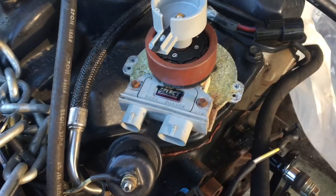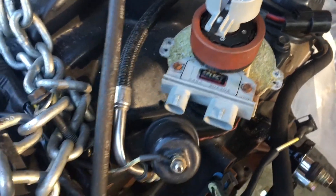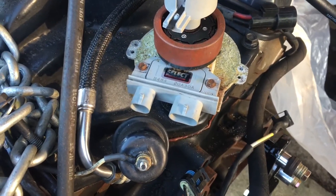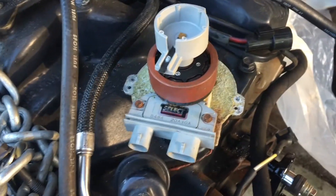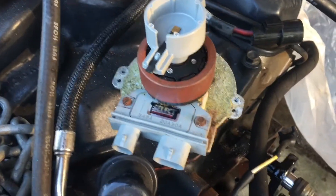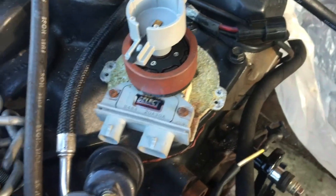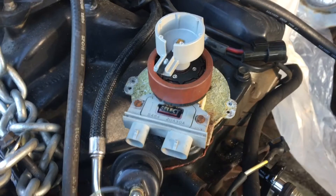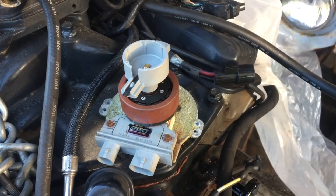So that's how the timing works. Marine systems are basically similar to cars, and they have built-in timing curves — that's what your marine engines are running off of. It's really not that complicated: you just take your timing tool, hook it up to your distributor, crank it up, and once you connect 12 volts to your bypass wire, you've locked the module at the timing you set by rotating the distributor. I hope this made sense — if you have any questions, put them in the comments and I'll try to answer them. Thanks for watching.